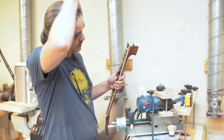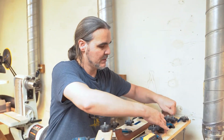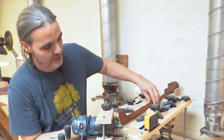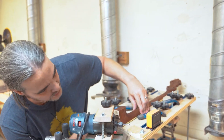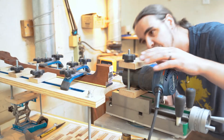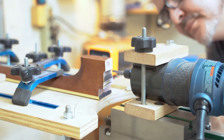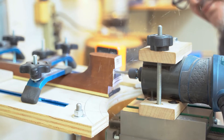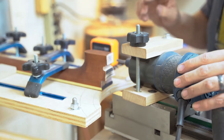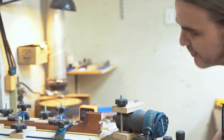This is our special router jig for cutting flange cuts. I center the neck on here. I already have the pitch of this table set for a seven-eighths bridge, which is what is going to be going on this banjo. Can't go too deep in it because then we'll get a lot of blowout, so we've got to keep it nice and simple. Now I need to switch the bits because the inside part of the flange cut needs to be square, so I'll be putting a square bit on there.